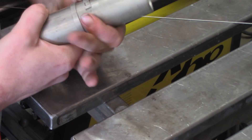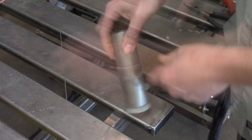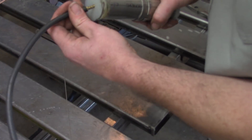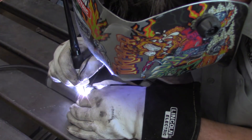Now, I like to put the gaps on opposing sides here just to minimize the heat, because we do have to bridge that gap up and we're going to do that with weld. Now, since this is stainless steel, we're going to have to purge it. So I'll pop a couple of purge plugs in, plug the line, get it pumping, and as soon as it's filled, we'll get to tacking.